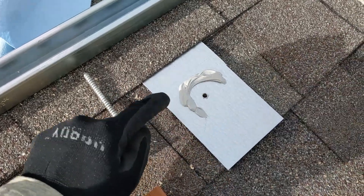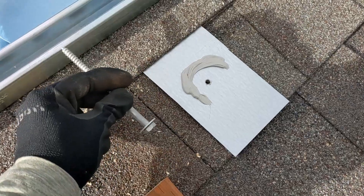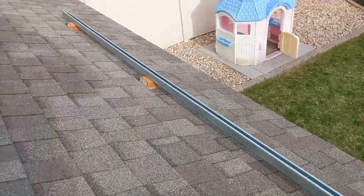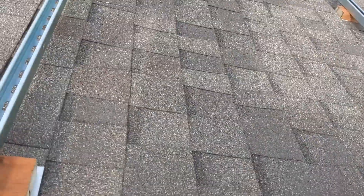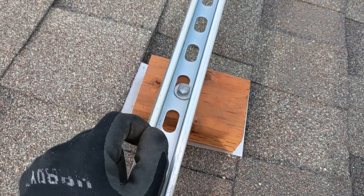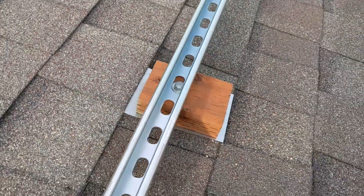I'm about to put this down. I have the flashing underneath the shingle, sealant up and around that, and sealant in both holes. This is a 5/16th 5-inch lag bolt — we'll put this on top, lined up with the hole. I just finished all six mounts. It's actually square from that measurement over to the measurement between these two. It's a 5-inch 5/16th lag bolt with a washer, a pressure treated two-by-four, the flashing, and you can see the sealant is oozing out on all sides, so I'm not worried about water getting through the roof.